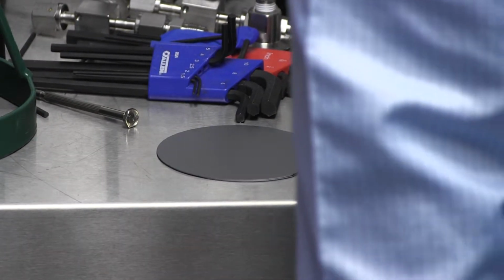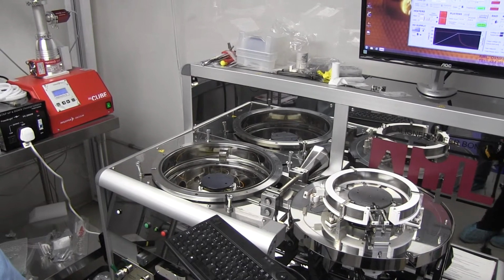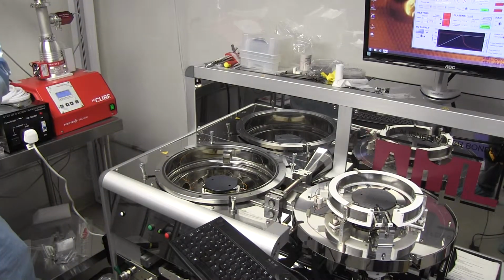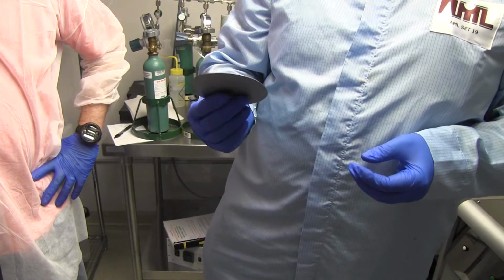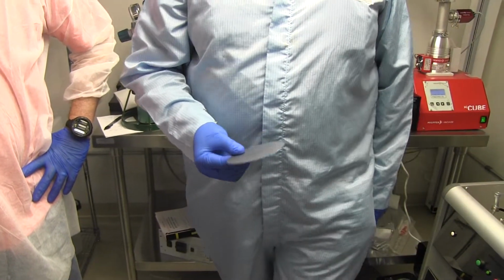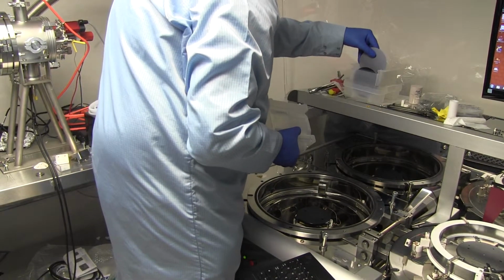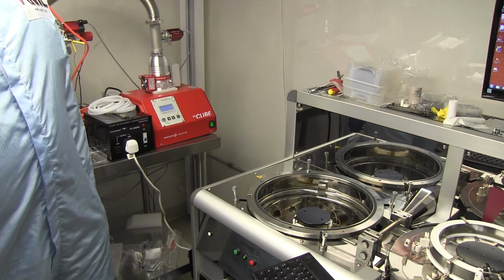What's the explanation for this? How does the direct bonding happen? For another bonding, we know, like, oxide bonds with silicon. I think we have at least a sort of Van der Waals bond, and that has kind of worked. If you put that in your furnace and try to anneal it, it would probably fall apart, but you can try. If you anneal it successfully and it doesn't fall apart, I'll be quite impressed.